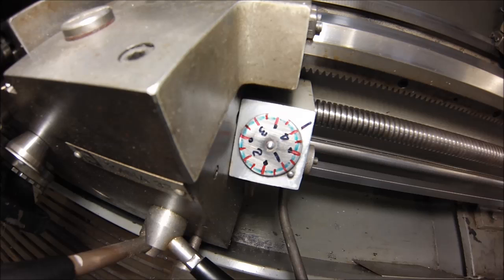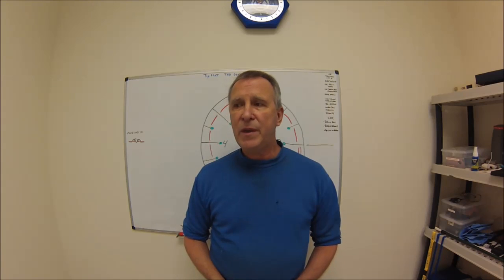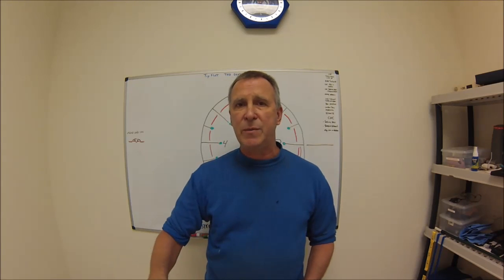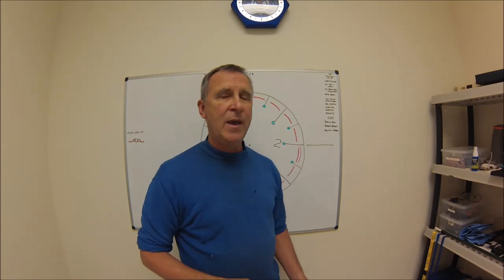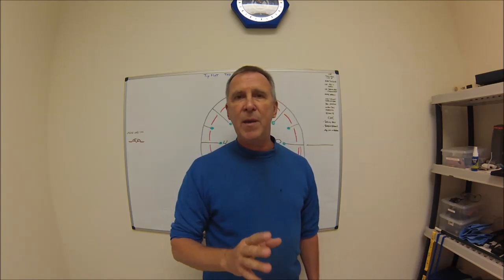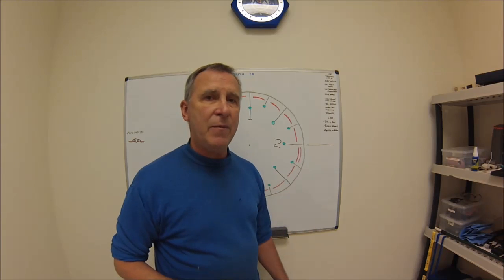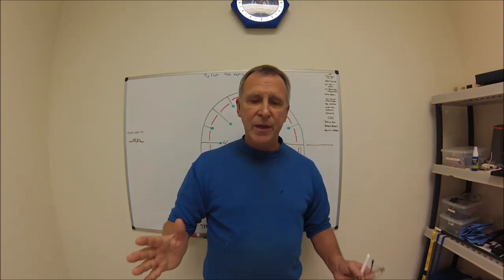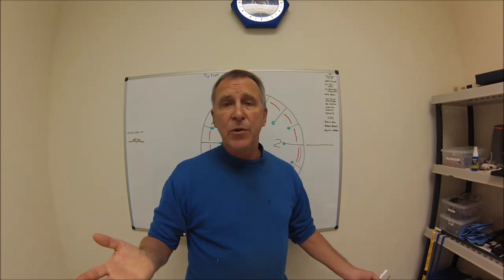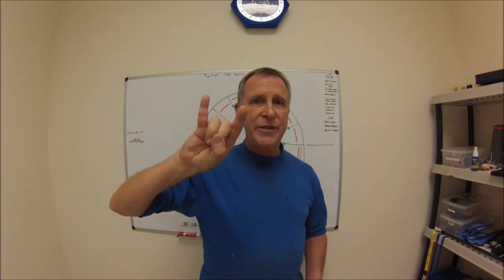Good luck. Sometimes the things we do so intuitively in a process we've done a million times are the hardest to communicate to someone who's learning. This is a really good trick, and I'd be surprised if there's any tradesman out there who waits for that line to come around without a momentary drag in the safe zone before the nut drops in. Check it out, try it out, mark up your dials, get your Sharpie markers out. Make sure the half nut is clean, the lead screw is clean, and slow the RPM down if the dial's coming around too fast — it'll slow the dial down. Simple. Hope you enjoyed that. Joe Pisinski, Advanced Innovations, Austin, Texas. I'm out.